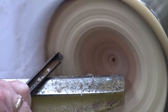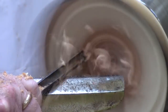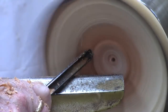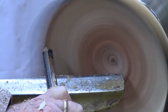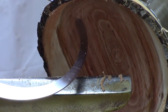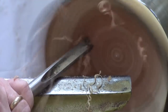I need to get that cut a little bit deeper on the wall thickness, but I've got the wall thickness about right. Now I'm going to remove a little excess at the bottom before I keep hollowing. I've switched to a different half-inch gouge with a more open U-shape — that works very well for a push cut on the inside of a bowl. I pick up that cut, ride the bevel, and just bring it on around. Taking calipers to get a feel for wall thickness — I want a uniform wall thickness all the way down. It's a little bit thick around the curve on the bottom, but I think I'll take care of that when I reverse the bowl.